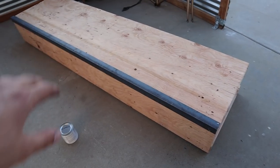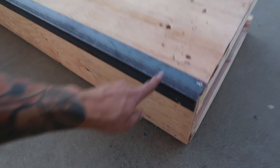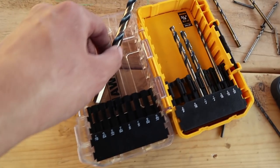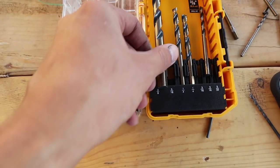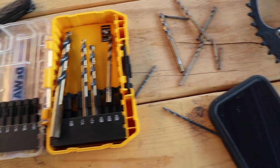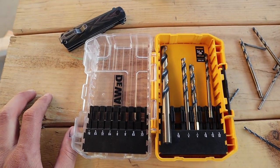The box is assembled. The screws that go into the angle iron and into the wood need to be countersunk, so you need to use a bigger drill bit to countersink them in. I've probably demolished about 75% of this drill bit kit by DeWalt — they're all snapped, all the ends are rounded. This trade isn't for me — shoutout to all the chippies out there. My hands hurt. Only thing left is to paint it. I bought some cheap primer — interior/exterior latex primer — should work well on top of the plywood, gives it a finish and will probably make it a bit more slippery too.